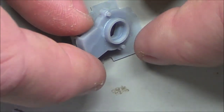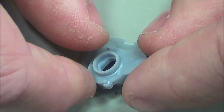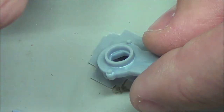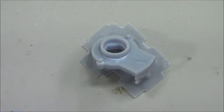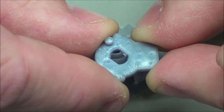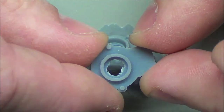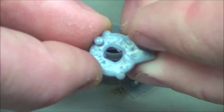Okay, I'm back with another version of the printed part. This time I did a more recommended layout in the printer, especially for an SLA printer like this: I printed it at two different angles. What that does is allow me to have a better build without a lot of what we saw here. See that kind of puffy look to it? That comes from trying to print completely flat into the resin area, and some of that is probably trapped resin inside of there, creating that flatness. It's almost like little pillow bubbles that are filled.